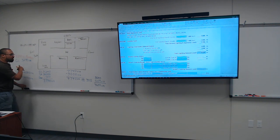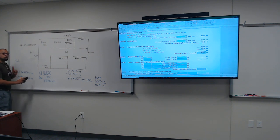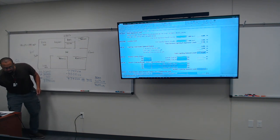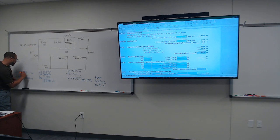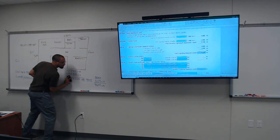So now, let me erase all of this here. All right, I'm gonna leave GL, that's for general lighting. Small appliances, we know small appliances is two, so I'm gonna leave it up here. So I'm gonna make this 3,000, all right? Now, it's because we know it's at least two, 15 times two is three, so 3,000.